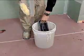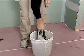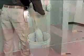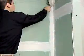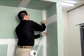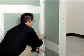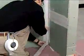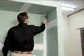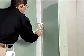Our second corner application uses a corner roller. First, place your tray into the compound and use it to help apply an even coat of compound to your roller. Then use the roller to apply the compound to the corner seam. Now you can apply FibaFuse to the seam. Once again, you can see how the fold makes application easy. Embed the FibaFuse and remove excess compound with your corner trowel, making sure to use the correct technique.